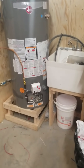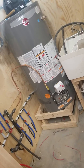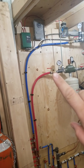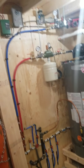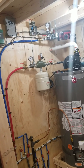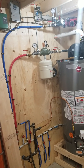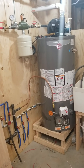The water heater is capable of heating water to 160 degrees, but the rule of thumb is you're not supposed to put water in your concrete hotter than about 130 degrees at the high end because it can crack. So I have that set to 130. The Grundfos pump is set to medium speed; the timer is half an hour on, 45 minutes off; and I normally have the thermostat set for 60 degrees — and that's plenty. As the temperature changes outside approaching winter — it's already three degrees Celsius here in Canada in early November — that may have to be adjusted. After a full season of heating I think I'll have it dialed in 100%.